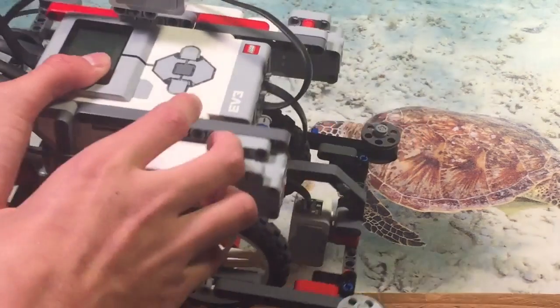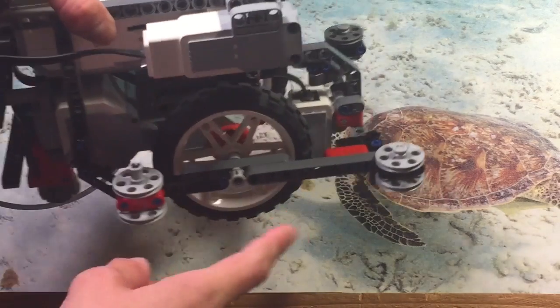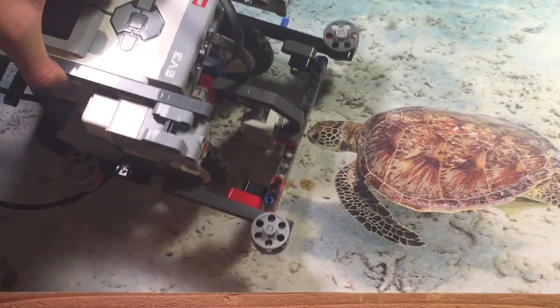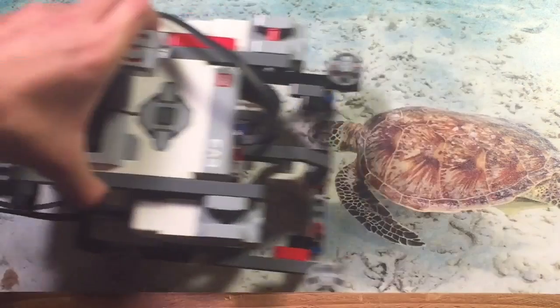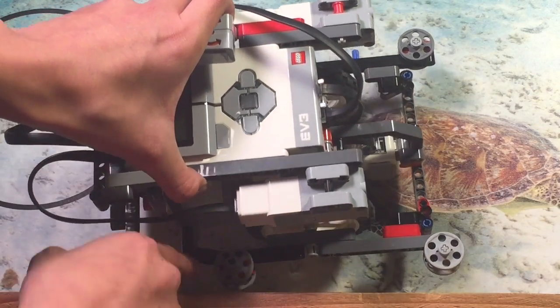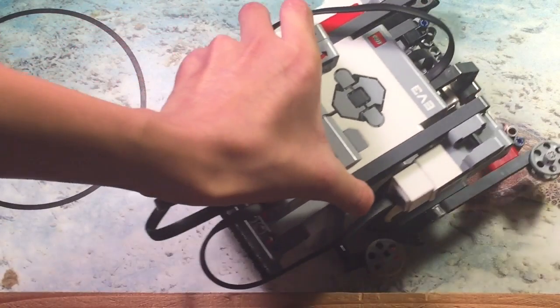Here's an example of a robot with wall following wheels on it. There's the driving wheel, the leading wheel, and the following wheel. When the robot is doing a curved turn against the wall, you want it to be a slight curved turn so it's pushing into the wall, and when you want to exit, that's where the following wheel comes into place and the robot will just curve turn out.